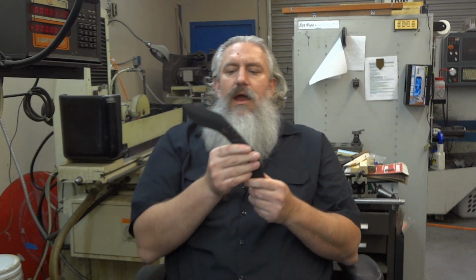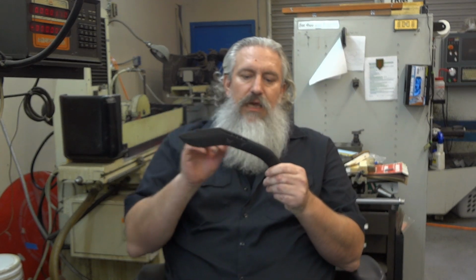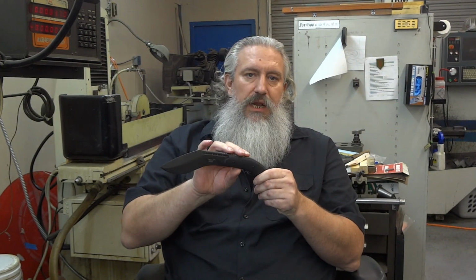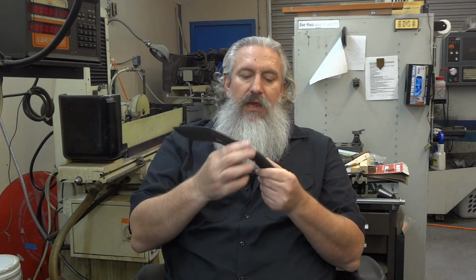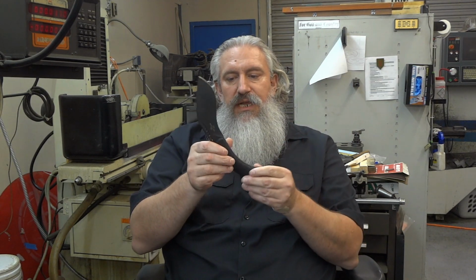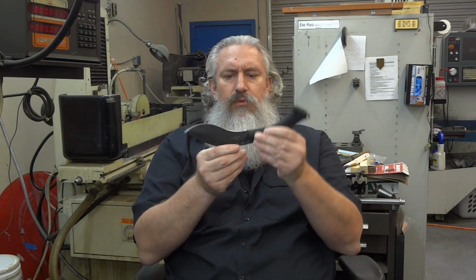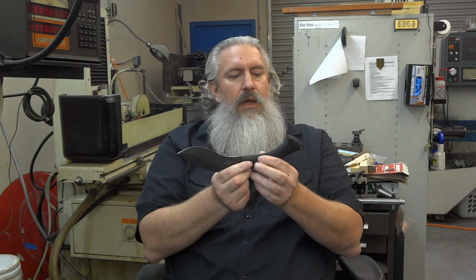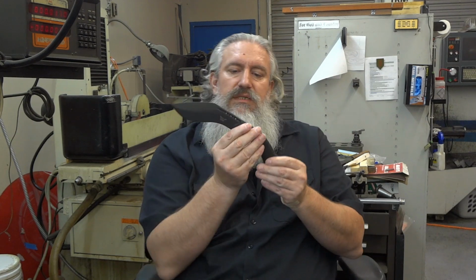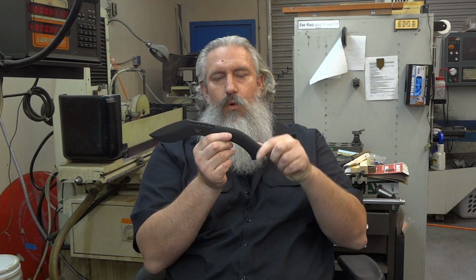These are going to be a little bit higher price than what they typically do, and there's a couple of reasons for that. The designs themselves have a lot more machining. The exposed radius tang, the Begg flute, all the jimping, the 3D machined G10 sculpted handles, and the grinds themselves. Especially this one, from what I understand, was the most difficult to grind, to get that swoop in there with that big curve in it. So there's a lot going on with something like this, and right now they're actually finishing up on the sheath work, and each sheath is custom designed and molded just for each knife.